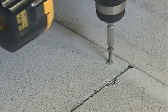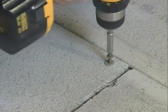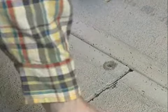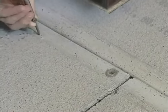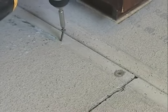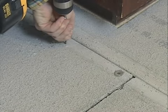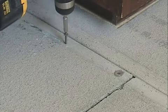Finally, nail or screw the backer board to the wood subfloor. Now, if you screw, use 1 1/4 inch galvanized screws that are specifically designed for backer board. The screws have a special head that grips into the backer board without crumbling it. You should put them every 8 inches around the edges and set them back about a 1/2 inch from the edge to keep it from breaking apart.